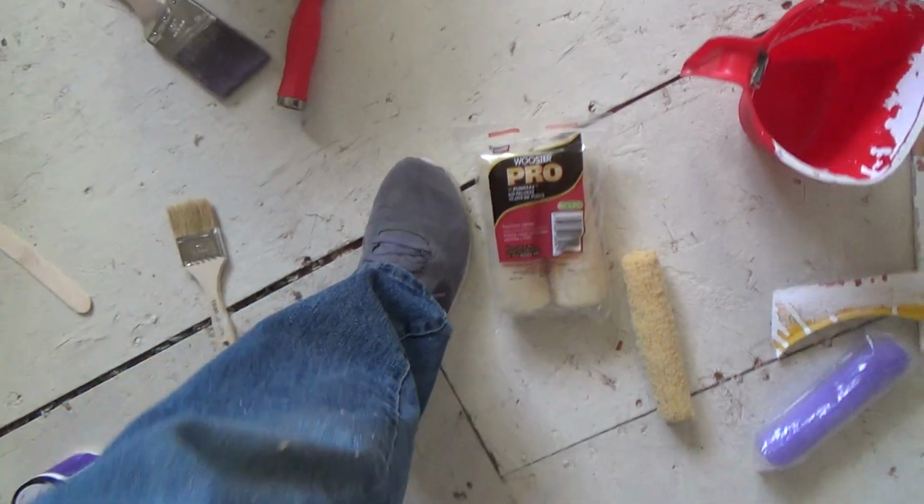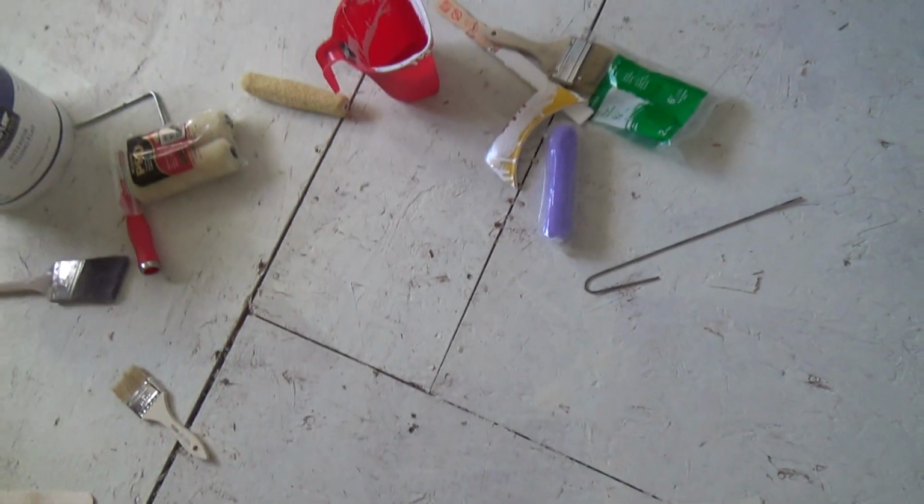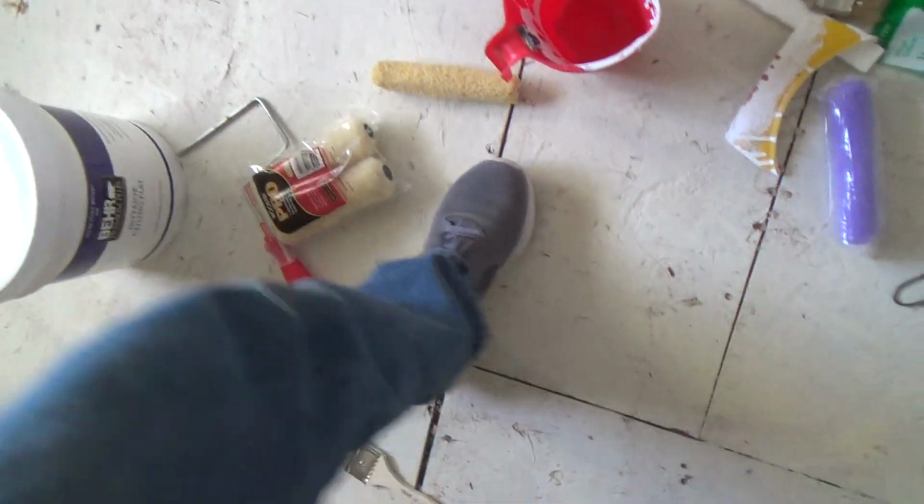Okay, I'll go through this, and I know there was a particular squeak in this floor, right? Look at that, how annoying is that? When you find them, mark them, and fix them. Don't just nail it. I mean, yeah, you could just nail it, and that could work, but later on down the road maybe the nail comes loose, or another surrounding nail. So I'll check this whole area. I'll put screws on both sides of the seam, boom, boom, boom, along there. I'll check this next one because I think there was more squeaks than just one thing.